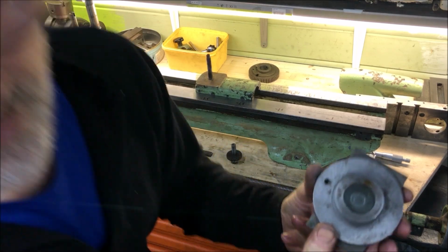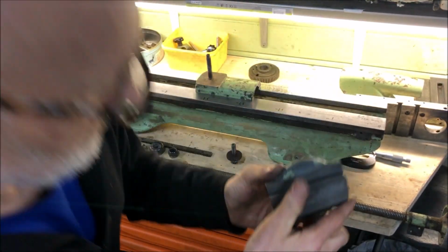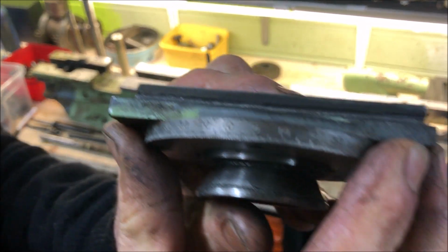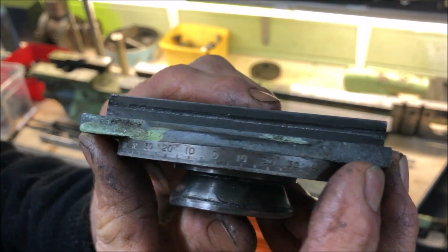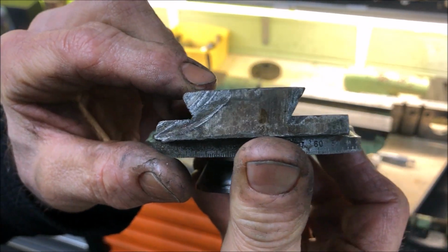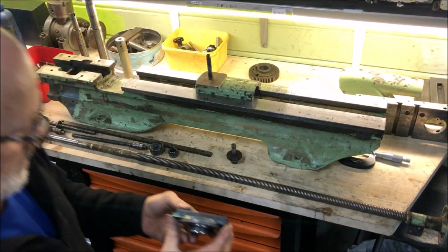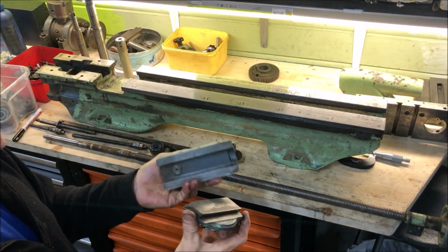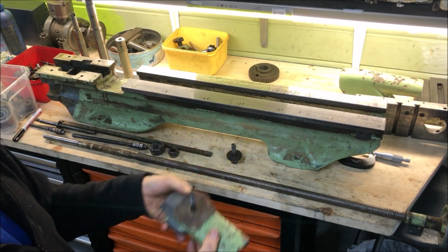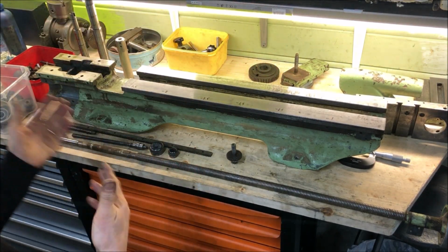as I see on the base here, it's not been rotated much at least, but I can see a quite heavy ridge there. So here there is a big wear ridge. So this has seen some wear. So you can learn a lot about how the machine has been used from what you have from wear.